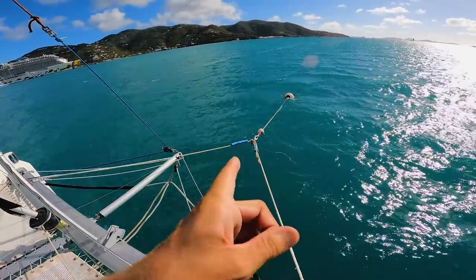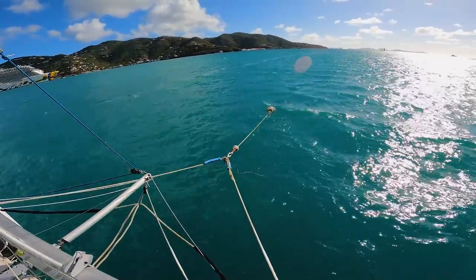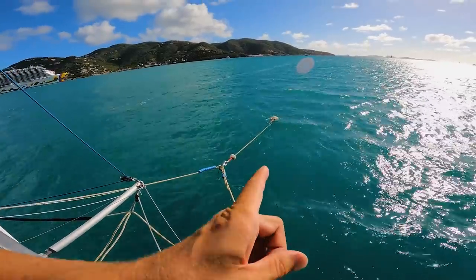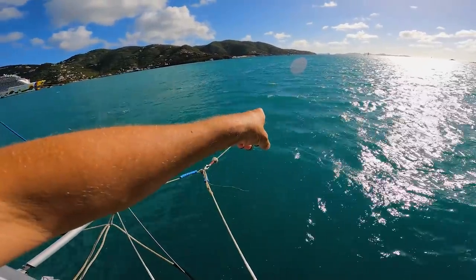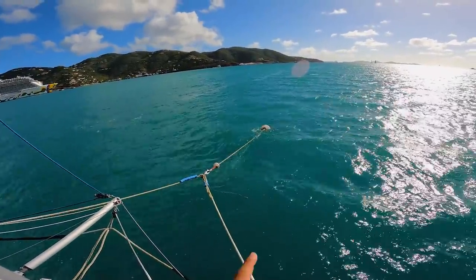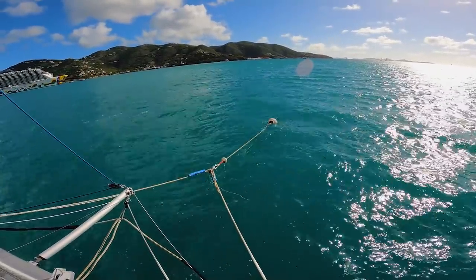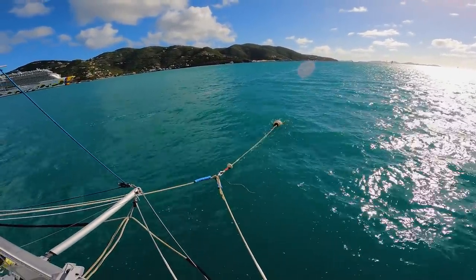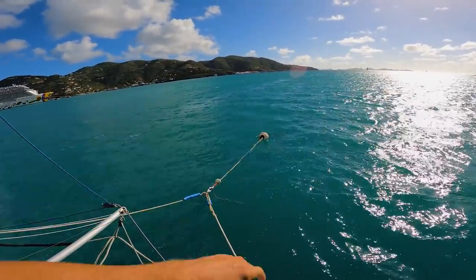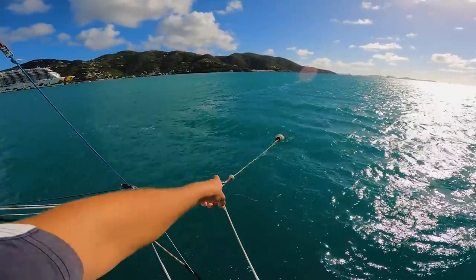A very important thing that you need to look at, if you catch the leader line or the mouse line, make sure that that line is good and strong. If not, the real thing that you actually need to catch is on the ball itself. If this one is good and strong as the ones on the ball and it will hold your boat, take the leader line. But if not, you need to take it right there at the ball. But we can see now the chain is there, so it will not be a good thing to actually grab the chain. So this is why we grab this one here,